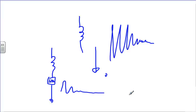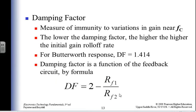The same thing's going to happen in an electronic circuit. When I tweak on the circuit, it's going to start bouncing back and forth. And then depending on whether I have it damped or not, it will go zooming up and blowing my fuse, or die off to nothing, or come to some equilibrium. So my damping factor is what I'm going to use to damp it out.